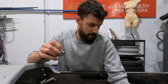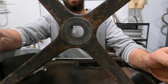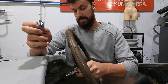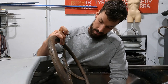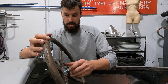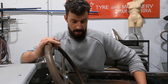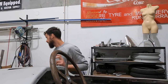And basically what's gonna happen is I still need to put a keyway in this to match the inside of the Model T. It's got the keyway, but I'll put a nylon bushing in here to help this from going back and forth, but it'll be relatively tight there as well, and then that'll press on the keyway, and then I'll do just something similar to this. I'll probably put this nut in the lathe and make it look nice. But essentially, once this is on and press fit, it'll be something like that. Everything's nice and square. And I'm just gonna put the nut in the steering box.